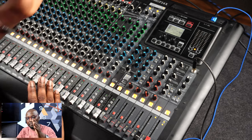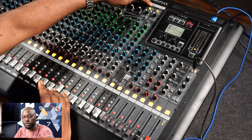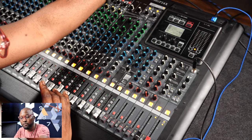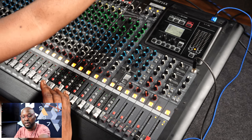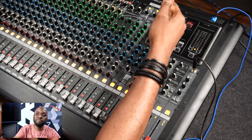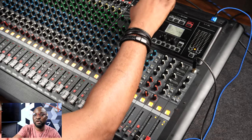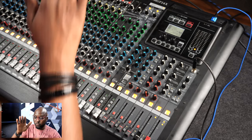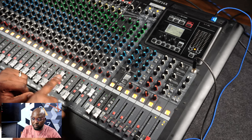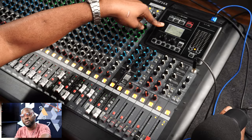And this is how it happens. According to this light, if channel 16 is lighting up, it means that I have to plug my microphone, which is going to be the host microphone, into channel 16. Okay? I put my iPod or iPad, I play music. When I'm playing music, the source for the music can either be 21 and 22, 23 or 24. That's where you plug your music. When they are playing, you push it up, your music is playing, and your channel 16 also, you put the volume up. Anytime you are talking, depending on the settings,